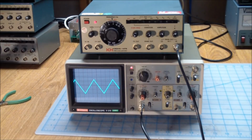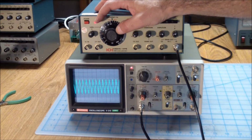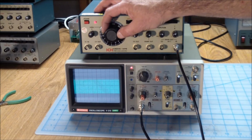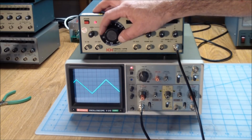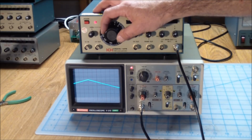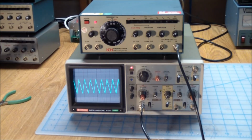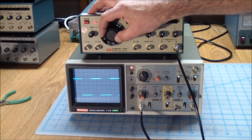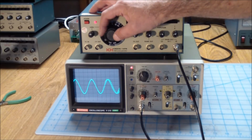Okay, that didn't take very long. It took me like 5 seconds. Put the dial back on, and it's straight, and it's fixed. I mean, you can see the effect of the frequency changing slightly when you let go of the button, but I'm willing to take that and have a non-wobbly dial on here. So, well, there's our triangle. Of course, our square and our sine.